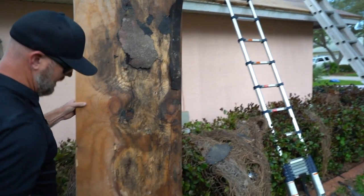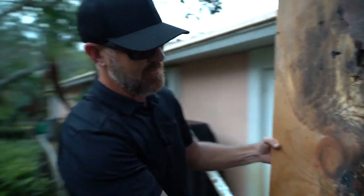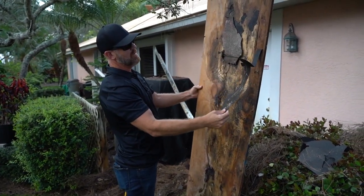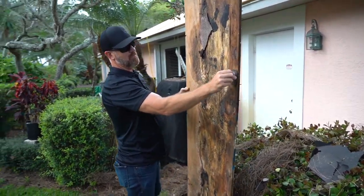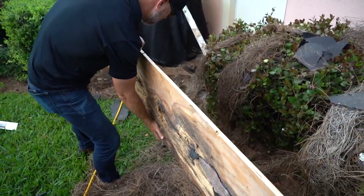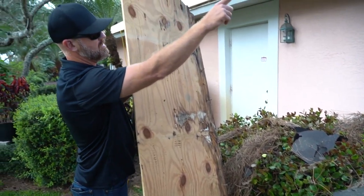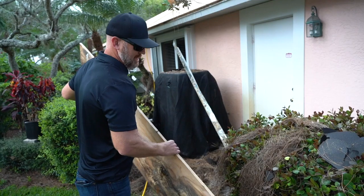The next piece I'm bringing out — I just wanted to show you guys since it was laying there. This was the plywood along the bottom edge, one sheet. You can see how the water was breaking down the integrity of the actual plywood itself. This is the 30-pound I was showing you on the roof — this went down first. This is the 90-pound that was mopped over top, and you can see how brittle this is. I'm breaking it with just my hand and pressure against the back of this plywood. You can see the back where the water was running down behind — that's the water marks you're seeing along the fascia as a result of water getting behind the underlayments and then behind the plywood as well.